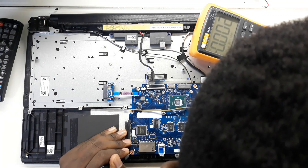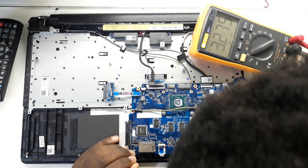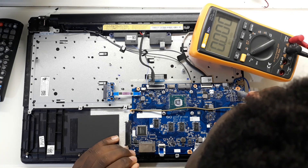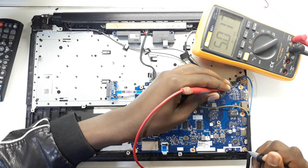So that's 19V here, 19V. And it is 3.3V on this side, and 0V on this resistor. So the signal that turns off the adapter is on.